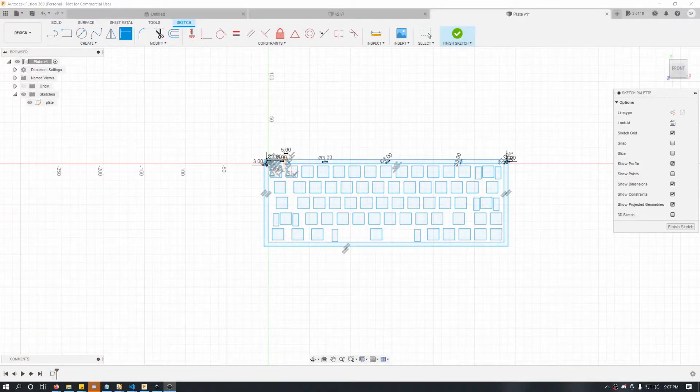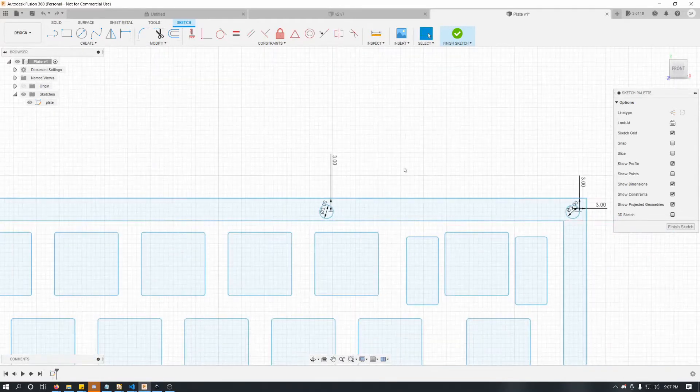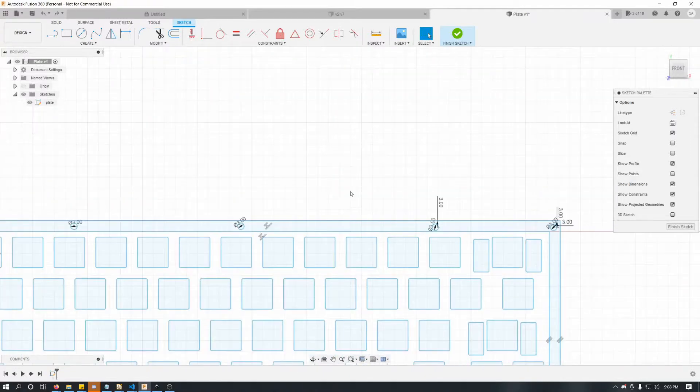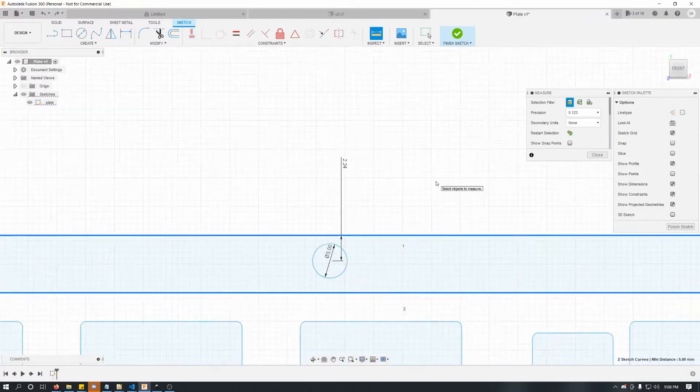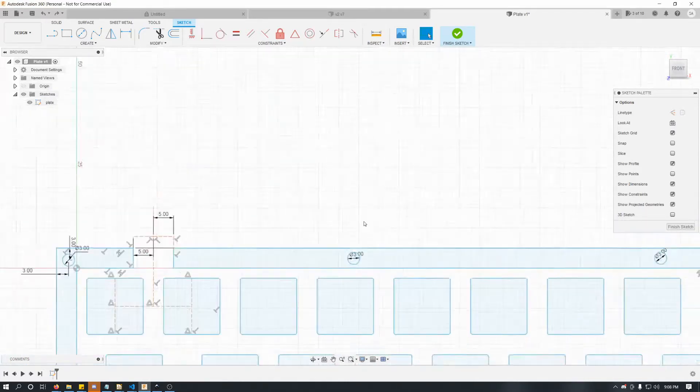Because I don't have thousands of dollars to throw away I decided that instead of trying to design a metal case out of aluminum or brass I wanted to make a stacked acrylic case. I started by importing my PCB outline into Fusion and created some offsets to get the basic outline to use for the other design cutouts for each of the different layers.